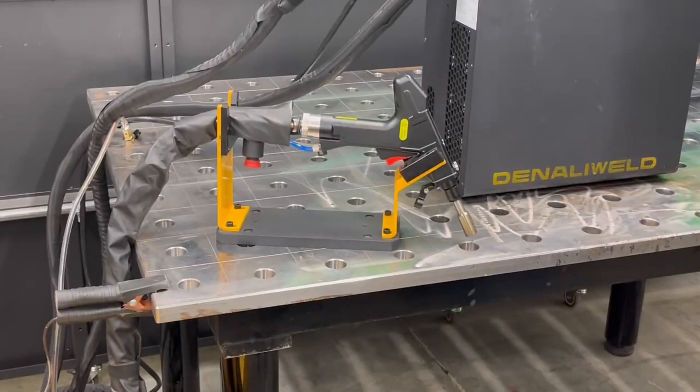On the new machine, we have built-in temperature sensors in the laser head. This protects the lens and can monitor the temperature of the welding head in real time. If the temperature rise is too high, the machine will stop working and give a reminder to the operator that it is time to change the protective lens. This will prevent the operator from causing further damage to the protective lens, or even worse, burning up a focus or reflective lens.